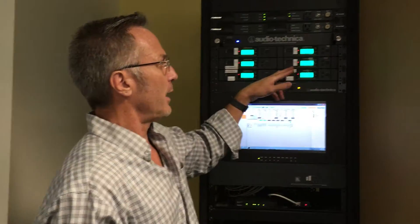So what we've done is we've checked the receiver and noticed that it's getting RF with the microphone off. The other problem you could run into is with the microphone on, it's cutting out. You would check that — you can check it on mute, by the way — to see if with the microphone on, your RF signal goes on and off. Anything like that, you need to get the frequency off of where it's at and somewhere else. Then log the frequencies that didn't work in a log somewhere — I actually have them on the inside of the rack here. Don't use those frequencies. Thank you for watching.